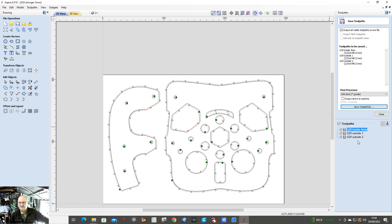You can see there, and you select which it wants to do first. Then we export a G-code file. I've ticked the output of all visual tool paths to one file. It's set to GRBL millimetres, which is what it is for this particular machine — and it's the same for my 30-30. It all goes to one file, and whichever is set up first on there it will do first. That's the actual file. That's been loaded onto the chip and I'm using the offline controller — it's not connected by the PC.